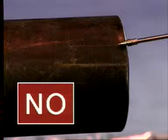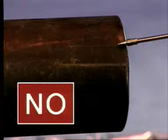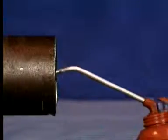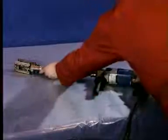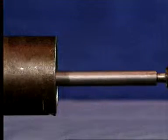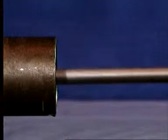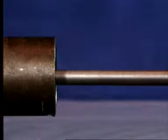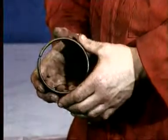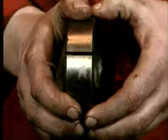Inspect both ends of the cylinder for cracks, usually caused by over-tightening or by excessive feed force during drilling. Inspect the cylinder bore for heat scores. A hone attachment will renovate the bore. On the relevant hammer models, make sure there is spring tension in the bottom spacer. If not, replace the spacer.